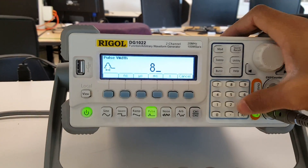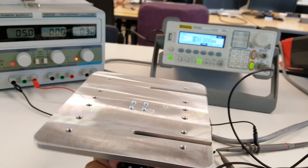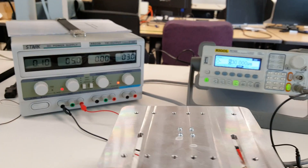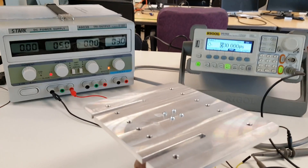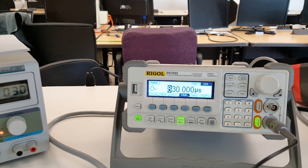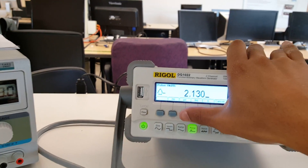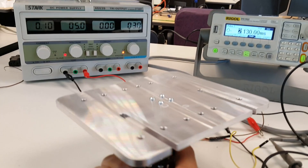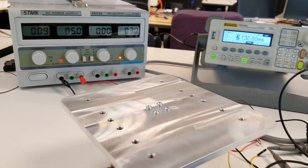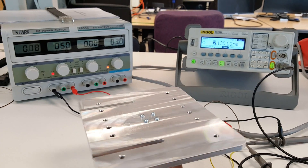That should be perfectly fine. I'm going to show you at 5 volts, with the rotunda, what the max-mins look like. The minimum is actually 830. And you can see the rotunda go, only drawing around 100 milliamps. And now I'm going to go to the next one, which is 2130 — so 2130 microseconds.